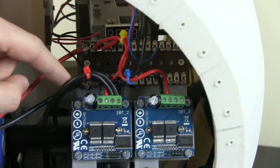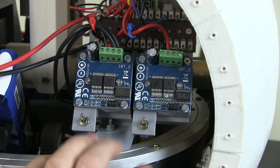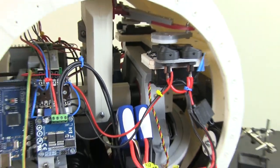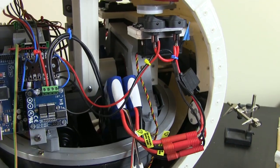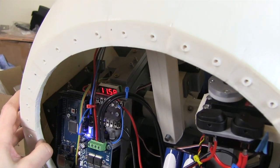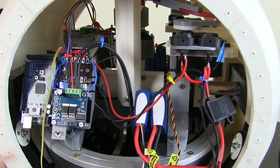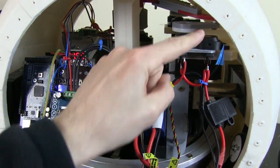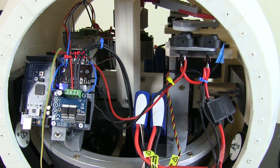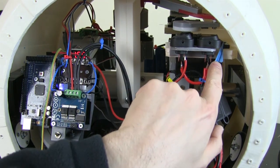That gives power — positive and negative on the rail — and I've dropped a bit of wire in and soldered it across to some terminals, then dropped that down to the motor drivers. I've already wired in the motor for the trousers for the side-to-side axis; the other will be for the flywheel which doesn't exist yet. Going back to the other side, I've wired in those batteries in parallel. Turning that on, the display should say 11.58 — nearly 12 volts. I've also got a fuse and switch that gives 12 volts to the regulators for the servos at six volts, and I've got these power regulators, one for each servo.